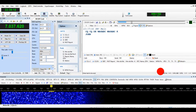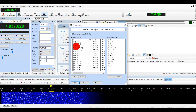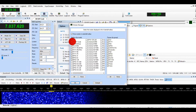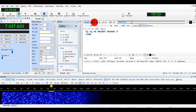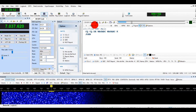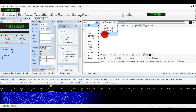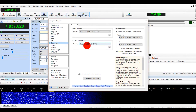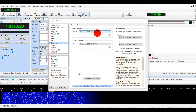Here in Ham Radio Deluxe, when you want to work CW, one of the things you want to make sure is to go over to where it says 'Modes' and make sure your CW is connected — CW key or Win key, and CW key command. You can click 'Key Command' and that sets up where you want to go. If you want CW sideband, that's A2 or tone modulated. In your program options, go to 'Sound Card' and make sure the output device is set to your USB codec, and the input is microphone or USB codec.